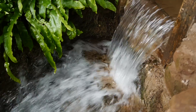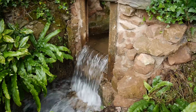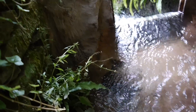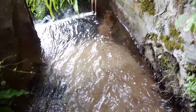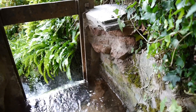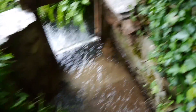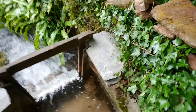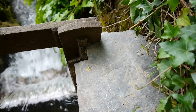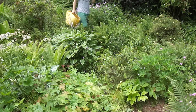Welcome back to my waterfall project. Last time I installed a sluice gate at the top of the waterfall. I put a layer of mortar on the back sides of the walls to make them more water resistant. The board is left in permanently to reduce the forces on the floor and hopefully stop a hole forming. I kept the wall tops with slates for aesthetics and to stop water, and especially ice in the winter, getting in. Shaping the slates to fit round the gate was done with a hacksaw, which works much better than trying to shape them with a hammer.